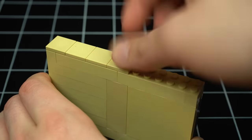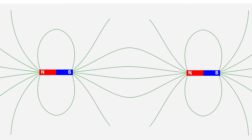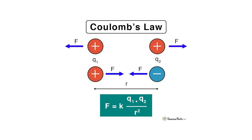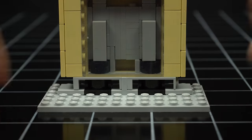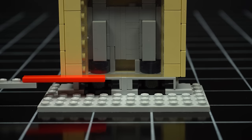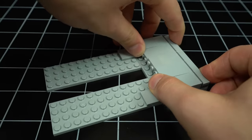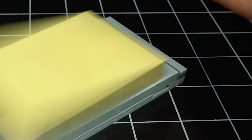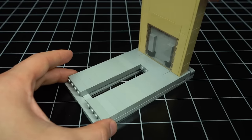There are two magnets in my oversized domino, and two magnets in the floor. Magnetic force is inversely related to distance as stated in Coulomb's law of electromagnetics. I eventually came up with a design that has the distance between the magnets equal to only one Lego tile, which I'm really happy about. Amazingly, these superpowered magnet dominoes solve both problems. If we scoot the domino away from where it should be, the magnets pull it back in. And if we twist the domino, the magnets realign it.